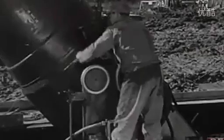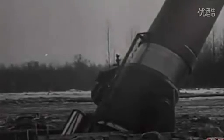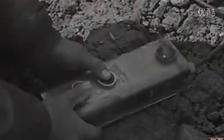The bright surface indicates the tube's recoil, 24.5 inches. This surface changes from the lower to the upper edge of the trunnion ring as the piece is pumped into battery position, shown by a light in the remote control box. Holding the piece in battery with one hand, the gunner pushes the firing button.